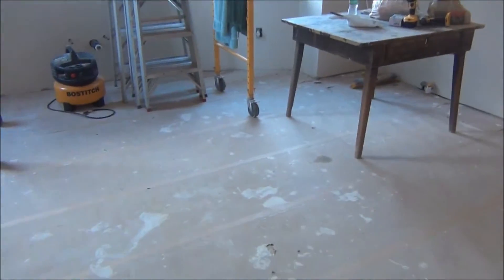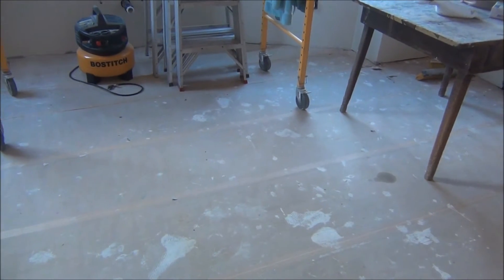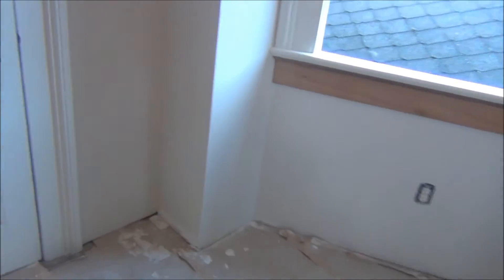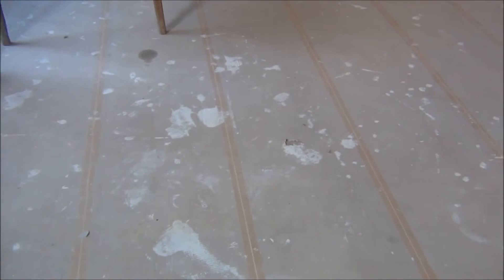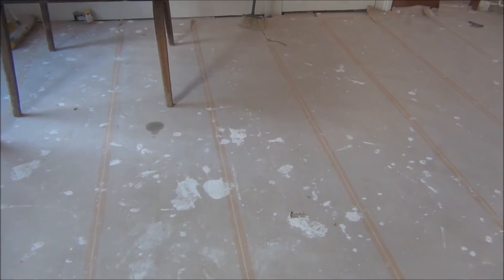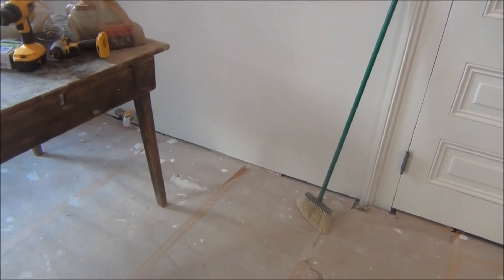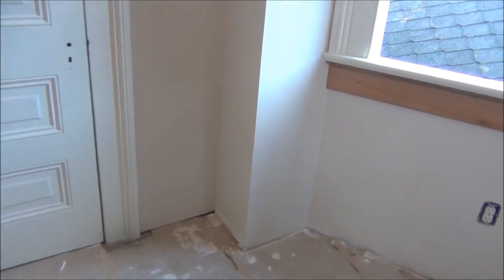After the painting's done — today is March 23rd, Wednesday. I work tomorrow, so Friday and Saturday I'll be fooling with Jeff trying to get all the painting and this stuff done. Then after that, get the floors done, recover the floors with paper again, get the cabinet guy out here to re-measure and order the cabinets. While that's being done, I'll go outside and start working on the side of the house — spackling all those nail holes, priming it again, and painting two coats of finish latex on the side.